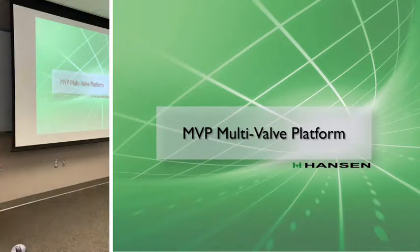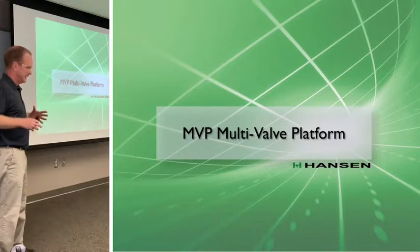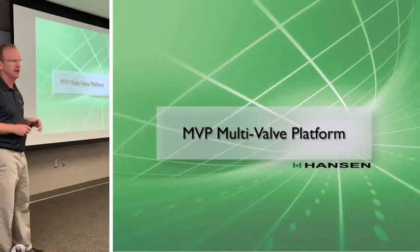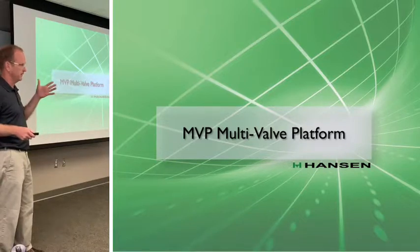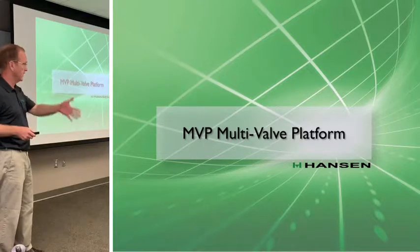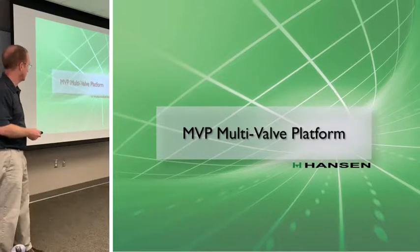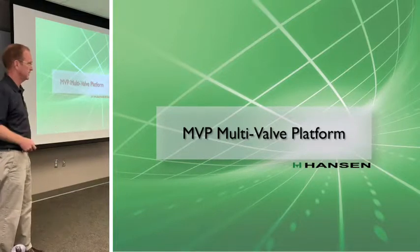Phil talked about solenoid valves, regulators, and I introduced the gas-powered valves a little bit. One of the things that's happened in our industry over the last five to ten years has been this consolidation of control valve grouping — meaning that where traditionally you would see a separate solenoid valve, shut-off valve, strainer, control valve, check valve, hand expansion valve on a liquid feed, and another isolation valve, the industry has really started to migrate towards multi-valve platforms where you combine that into one single block.